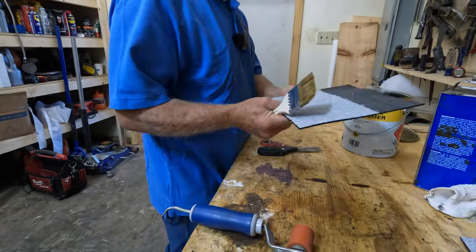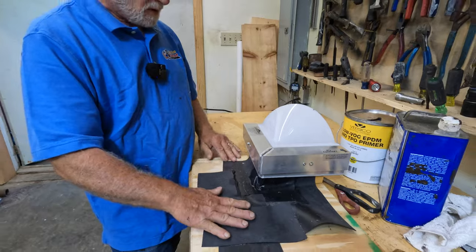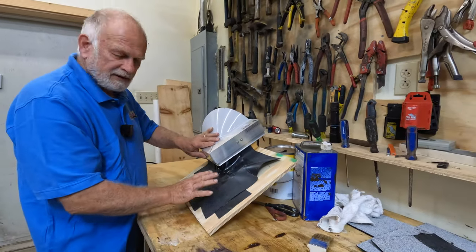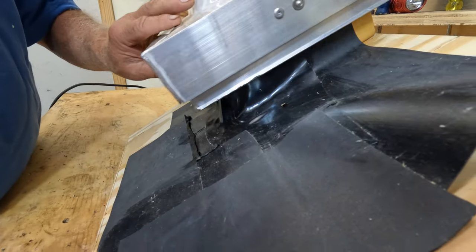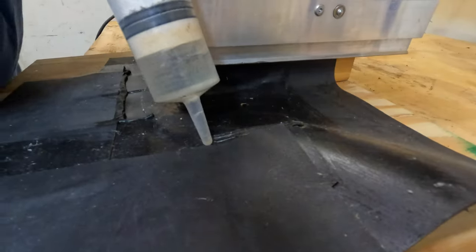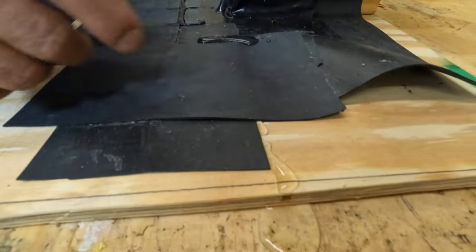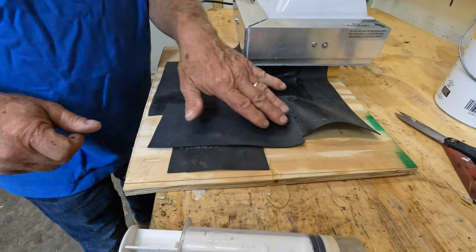I made a sample to show you a general idea of a flat roof. EPDM has a lot of seams around skylights, curbs, and flashing, and these seams are where the secret is - where people don't know why it's leaking. I'm going to put water in there. Look - it's coming out here! You see that? It's going from this seam all the way to there, coming out there. That is the problem.